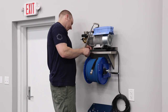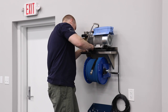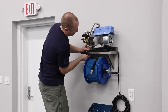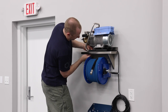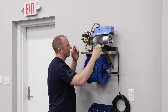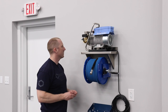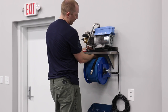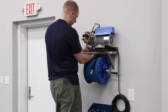These are size-10, five-eighths-inch-long stainless hex bolts — stainless probably doesn't matter but I wanted to match the shelf. With a little wing nut up under here. If you're going to be taking the pump on and off periodically, give yourself more room. I tucked it up into the shelf and it's a pain to reach, but I don't think this pressure washer is going anywhere. You could also mount the pump to the shelf and just lift the whole shelf off in one piece.